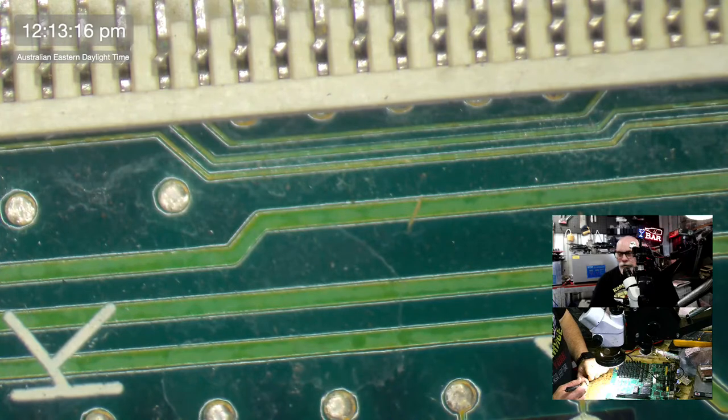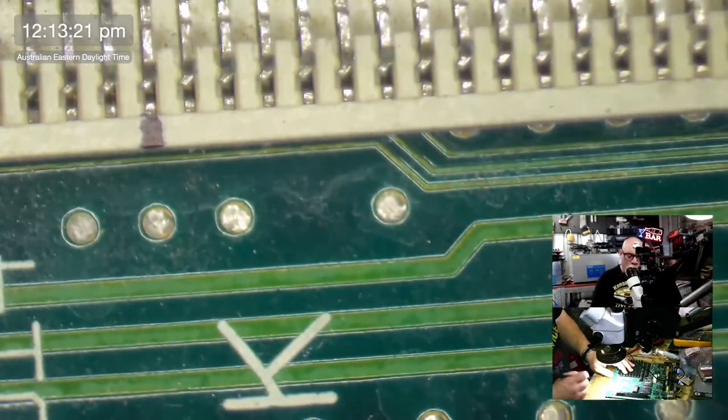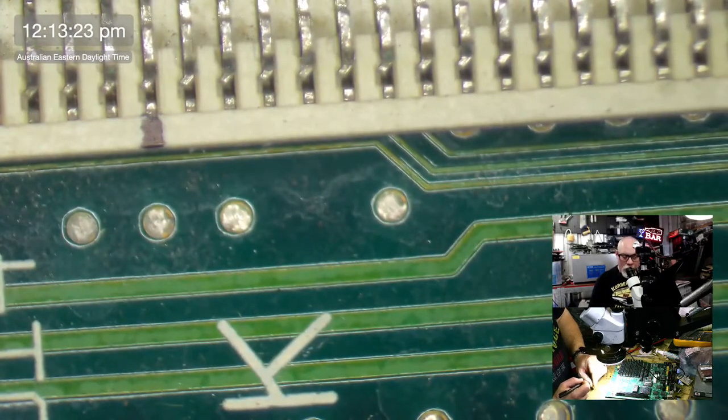And so, a lot of that is why I'm going through and marking out these dots on the ROM sim, because a lot of this is going to be about tracing things through, actually getting the multimeter out, doing it the whole boring way, but just making it so that we have all these connections restored.